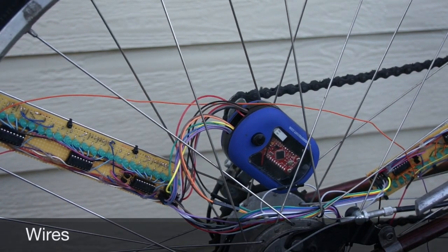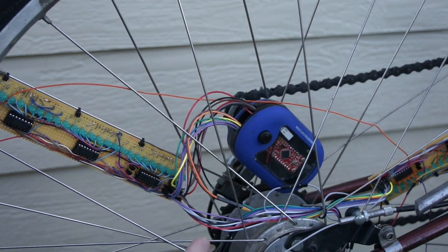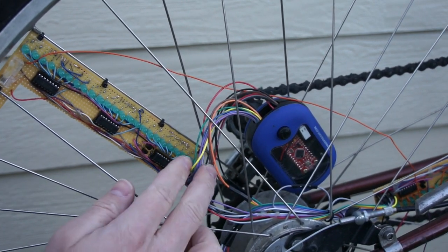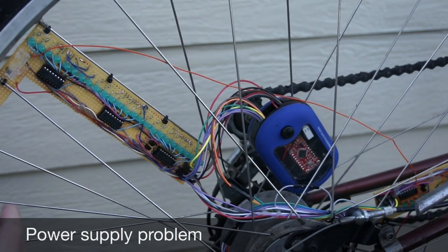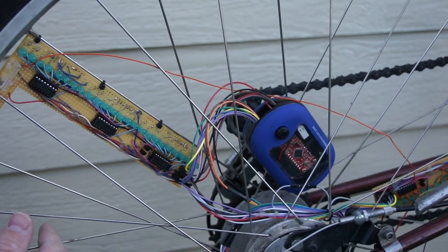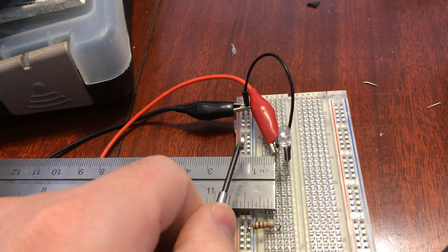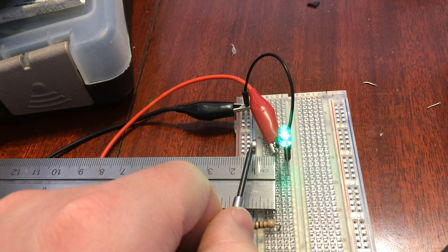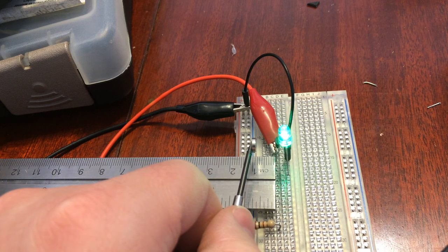I would have soldered all this in, but I decided it would save me some time to use the pin headers and all the existing wires I already had. After I got the thing together and a bit of experimentation, I realized that my Hall Effect sensors — it's on the other side, just pointing out where it ought to be — weren't getting enough voltage to register the field.